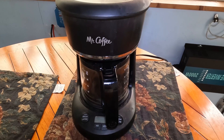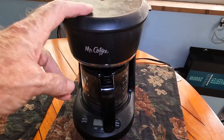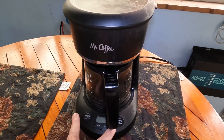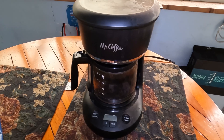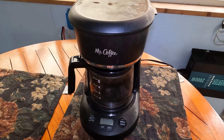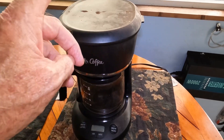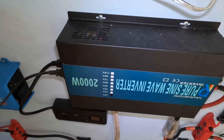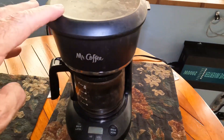If you can't live without coffee from an electric coffee maker, keep in mind that anything with a heating element draws a lot more power. A smaller four- to five-cup maker pulls over 600 watts when on. Larger coffee makers use 1,000 to 1,500 watts, so you'd need to be sized appropriately. I couldn't run this coffee maker on the 375-watt inverter, but tied into the 2,000-watt inverter, no problem — I could run a much bigger coffee maker if I chose to.